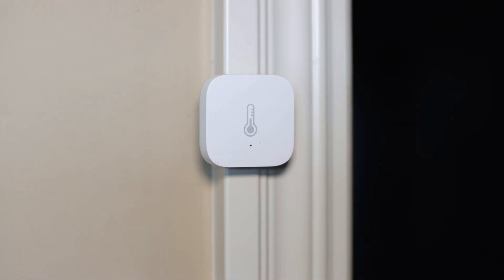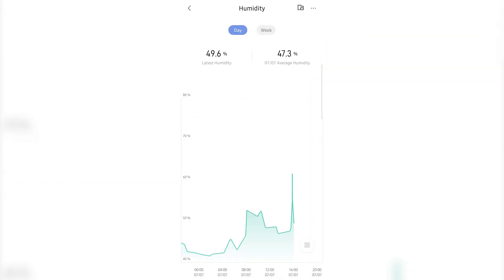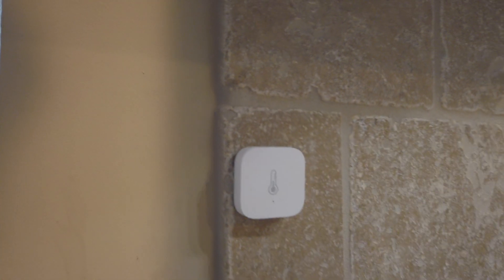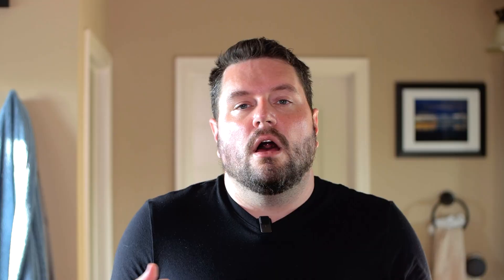The humidity-controlled fan Blueprint is fairly simple. You select a humidity sensor, set a reference humidity threshold — I've got mine at 60% — and configure how many percentage points the humidity must rise or fall to trigger the fan on or off. You can also add a second humidity sensor from elsewhere in the house to prevent false triggers from high ambient humidity. These sensors provide temperature, humidity, and barometric pressure all in one tiny package, which I've even used inside my humidor.